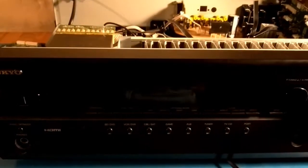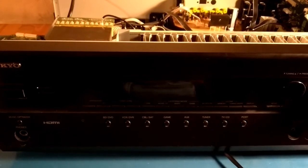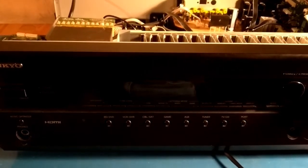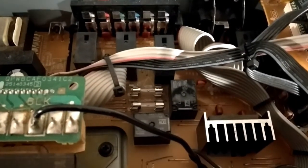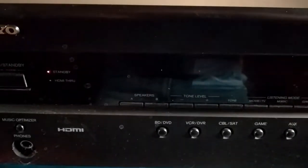Now one of the things you can do with these, just to sort of check that it's not totally dead, is remove the two main fuses — two little glass fuses down in there by those two relays — and it should stay on if I take those out. You need to be careful taking them out, because if you break them you'll have no fuses for it, and you really need to use the same type of fuses.